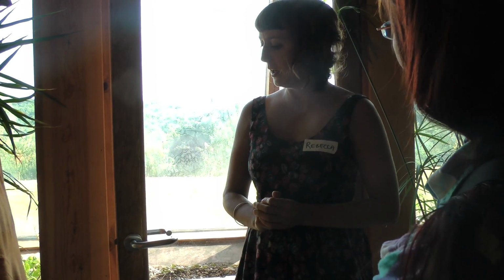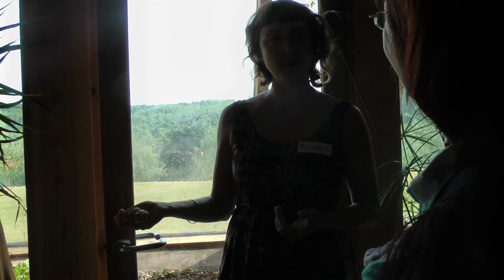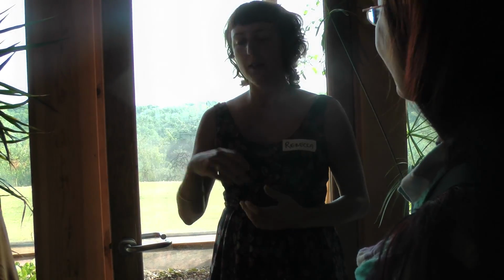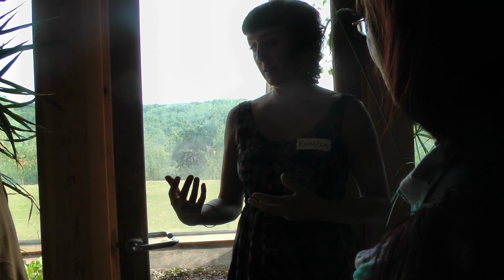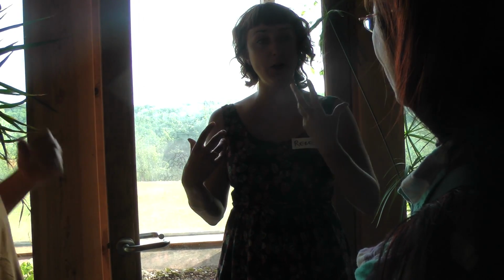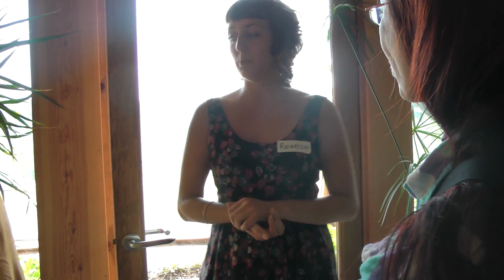Okay. So a lot of people might think, well, this is great, but I'd like it a bit smaller and just out there. But the trouble is, Mike Reynolds says that you should have 2.3 metres squared per plumbing fixture. So if it was smaller, it wouldn't be able to cope with the amount of water going into it. So that's why it is as big as it is and why it has to be quite big.